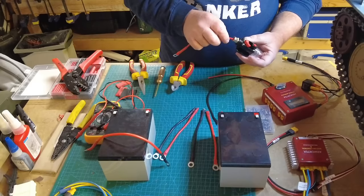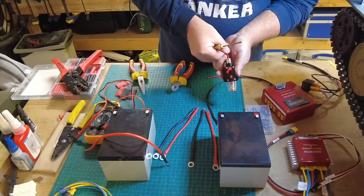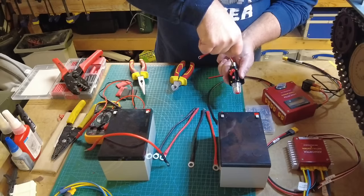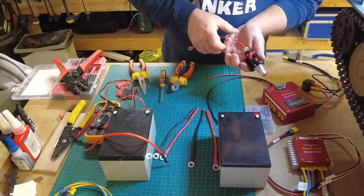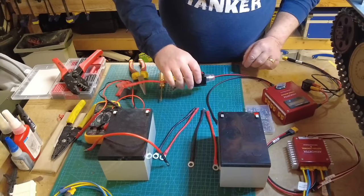making sure that it's only going into the cable. Don't want it hitting the insulation. You want to get the right connection. Just holding it there very gently. Just winding that grub screw in. And now tightening it up. Making sure, give that a tug. Wind that in. And that is that. We do exactly the same on this side.